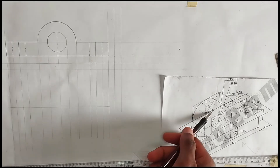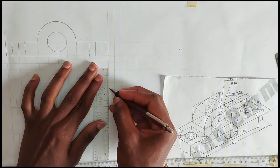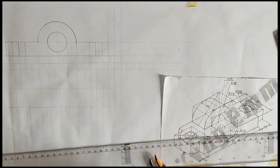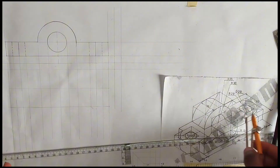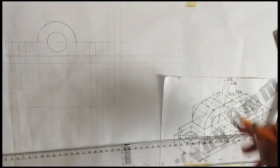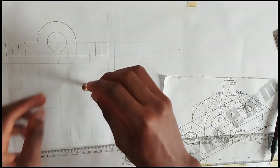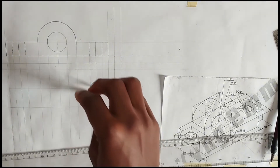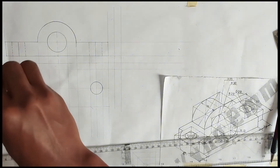Now in this place this is 30 mm, so we are going to be picking 30 mm from this point. From that 30 mm we draw our straight line — please make sure it's with tinting lines. From this point we can see that these two lines are representing the circles that are here, and since we are viewing it from the top we are going to be drawing the circles. We place our compass at this point and draw picking 10 mm radius.